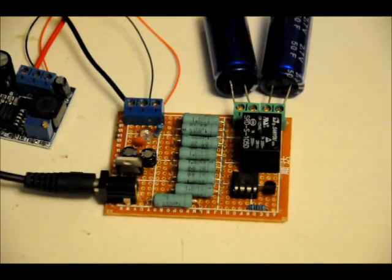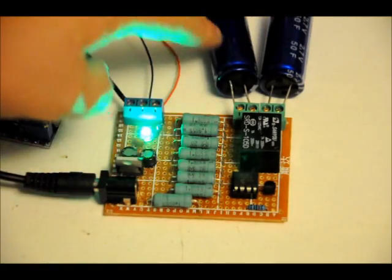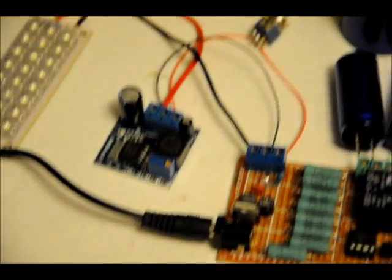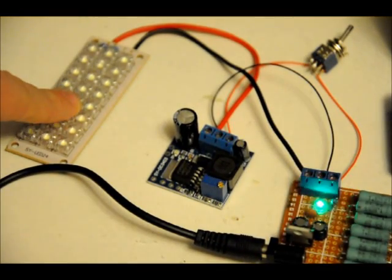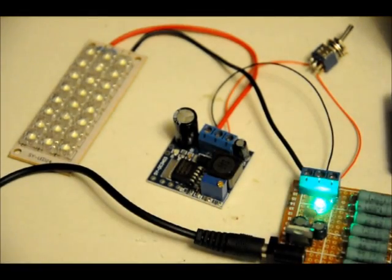Now the LED is flashing, the relay is turned off, and the charge to the capacitor has ceased. There are now two isolated circuits: the capacitors and the digital circuitry. There's absolutely no power going into the capacitors. The power from the capacitors is now transferred to this terminal block — there's two grounds and one power. I've got 5.2 volts and a ground going to my digital booster, and another ground going to the LED bank. The LED bank ground goes back to the main board.